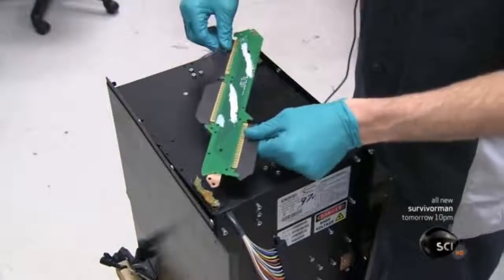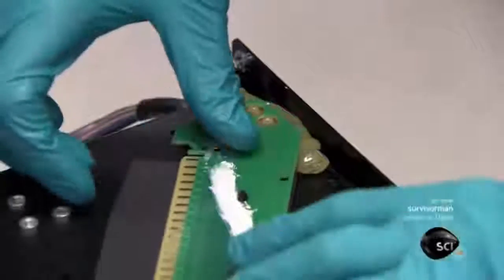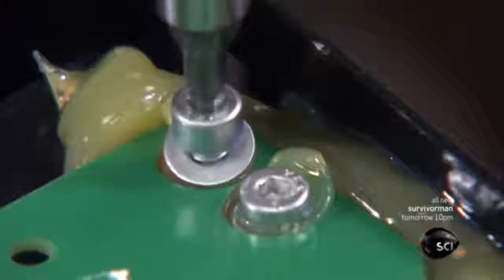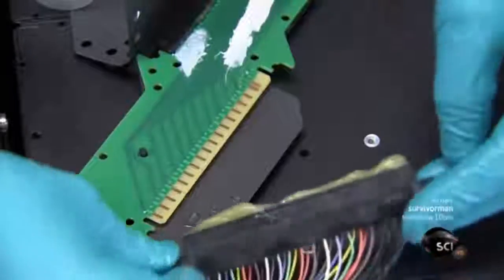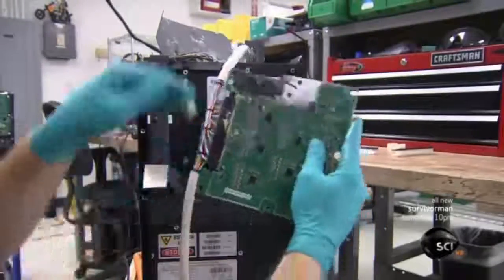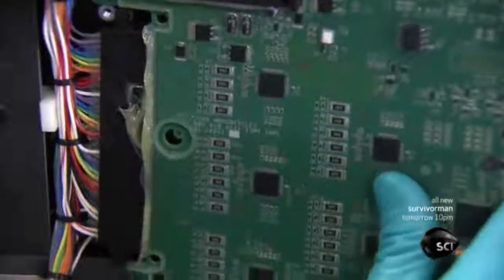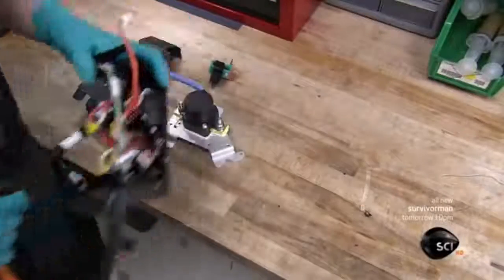The motorcycle's battery contains four cell boxes. To link all the cell boxes, they install two interconnect boards, then plug the connectors from two cell boxes into each board. They use lots of grease to waterproof the battery and protect it against corrosion caused by road salt or sea air. Next, they plug wires from the two interconnect boards into a circuit board — the battery's brain — which regulates the voltages of the individual cells to prevent overheating.